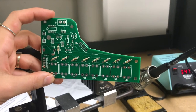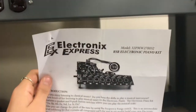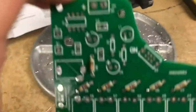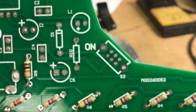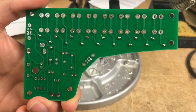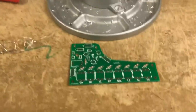We are here in ENT Electricity Lab with Professor Reni working on a piano from Electronics Express. We've soldered all of the resistors on so far. We have one left, R10. We had a slight problem with R9 where the solder came through, but we've handled it. We have to find another orange-orange-brown 330 ohm resistor to replace it with.